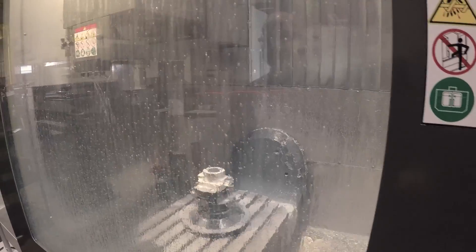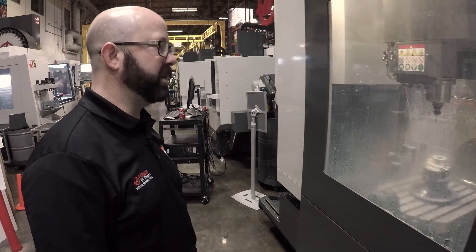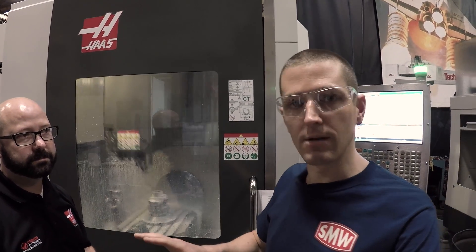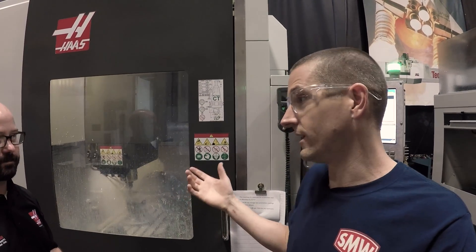Good lesson, folks: if you're new to machining or trying to maximize productivity — short tools, stubby tools. Avoid chatter, avoid extra gauge length when you don't need it. A lot of guys when they buy a new machine buy the longest tool they can to make sure it works on every job, and it's the worst thing you can do. I bought short ones — I didn't know what to buy, so I literally bought 10 Maritool 1.75-inch gauge length ER32s. I could do drills, probes, indicators, end mills — everything but a face mill. It was totally the right call. I do have a couple longer gauge lengths for when I need to reach into things, but otherwise keep it short.